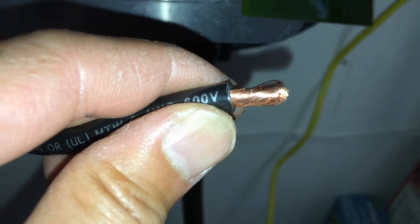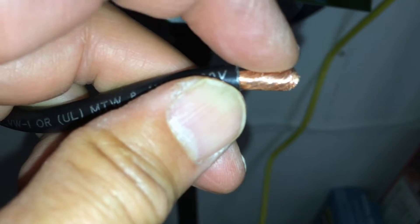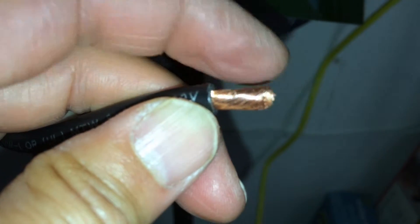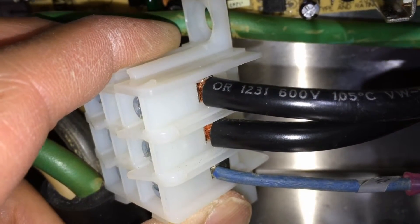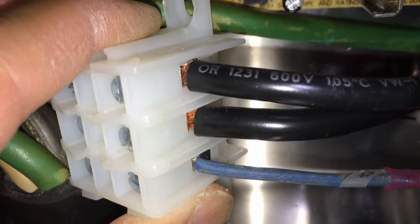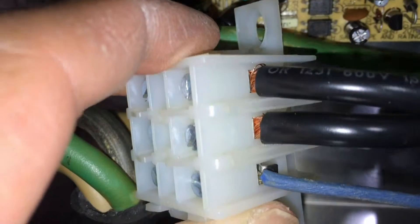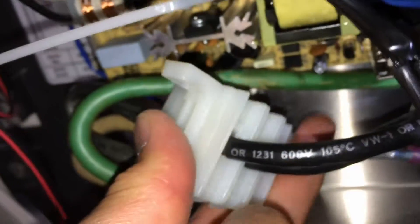So what I've done is I've taken these wires out. I first thought I'd solder them — which corresponds with what I've heard techs have been doing — but soldering is extremely difficult because there's very little room in that terminal block. Also, solder does not conduct electricity as well as copper, and the industry standard in high-voltage, high-current applications is to crimp. So instead I've cut this back, trimmed all the wires, wound them tightly, and inserted them into the terminal block, being very careful that I don't see a single strand popping out. After the job is done, I've trimmed some of the end because it was too long, tightly wound them, and inserted them. Even so, I see one strand on the top just ever so slightly peeking out — but that's not going to be a problem. On the backside it's completely clean.